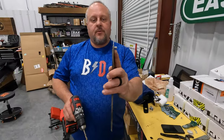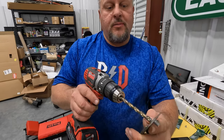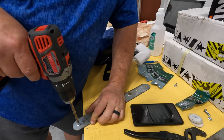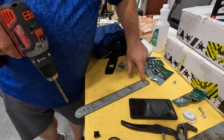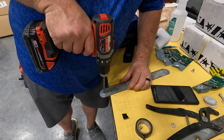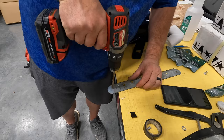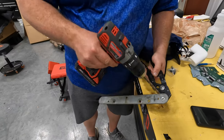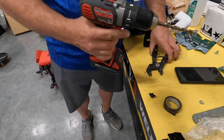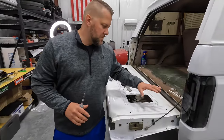If you've never removed a pop rivet, once it's stuck in there it's still swelled in a little bit and won't push out very easy. You can take your drill and come at it from the top side — don't go all the way through or you'll enlarge your hole and make it too big. Just hold it from the back so it doesn't spin, and that'll pop them right off without damaging anything on your bracket. Just a little tip.